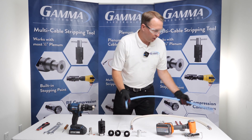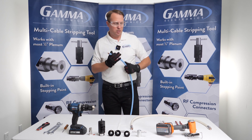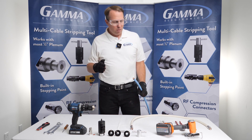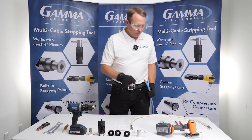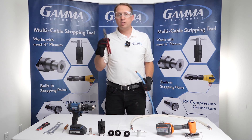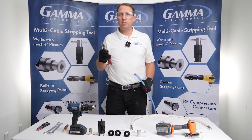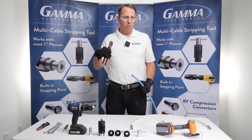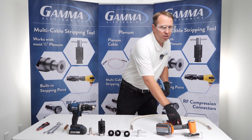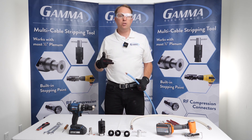What I've got right here is an RFS cable — this is a half inch plenum copper RFS cable. Cutting cable is a little bit tricky. A lot of guys like to use cutters like this — this is a Klein cutter. We did some modifications to it which make it cut a little bit better, but usually they're a lot thicker. They do a good job at cutting but they're not very square, and that poses a problem when you're trying to terminate cable.